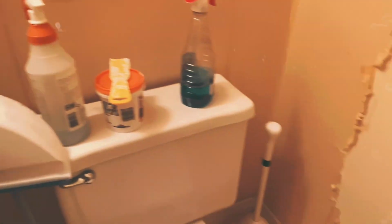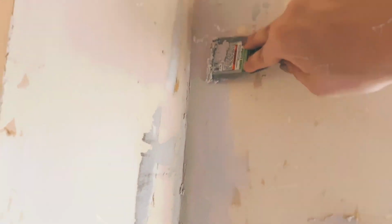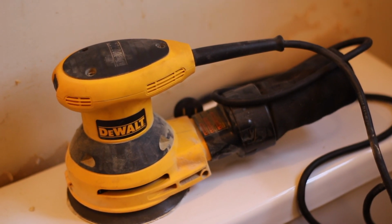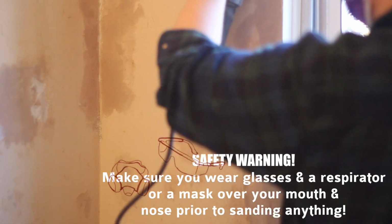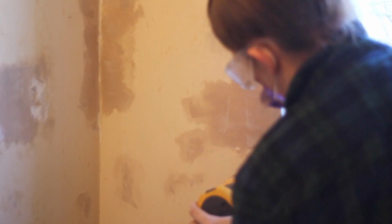Okay, ladies and gents, I do have a lesson for you here. My dad wanted me to try using a specific floor compound on the walls. And though I had a gut feeling this wouldn't work well and pointed out it was floor compound, he asked me to try it regardless. Guys, please listen to your guts. This compound completely screwed over a portion of the walls I was repairing post wallpaper, and its grainy, gritty texture wouldn't smooth no matter how much I took my electric sander to it. It was not worth it, and I should have stuck to my guns and completed the wall repairs to my own preferences. My dad ultimately regrets not just letting me work in a way that I found productive and necessary,